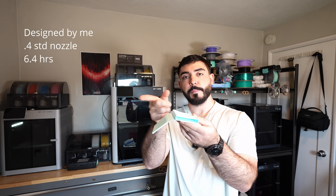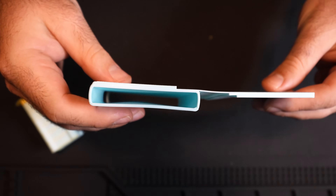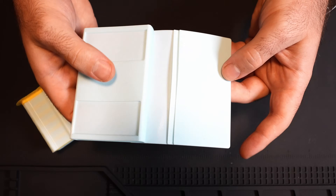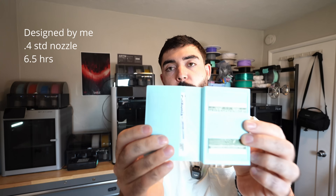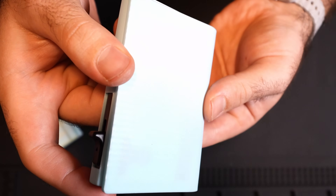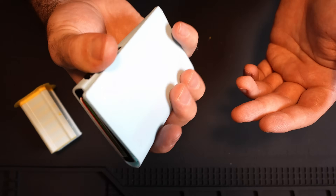For the next attempt, instead of having the flap over the top for memory, I thought the weight of the cards once loaded up would just keep it in place, so I went with an all flat design and adjusted some dimensions. After a couple more iterations to get the tolerances just right, I ended up with a super cool 3D printed wallet. You can put cards in the back pocket, the wallet section works great, and the flap is awesome. This stuff is wear resistant and abrasion resistant, so I think it's going to last for quite a long time.